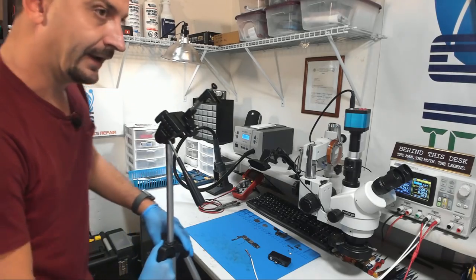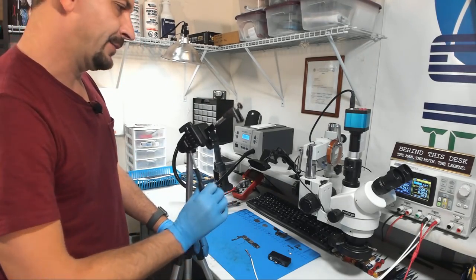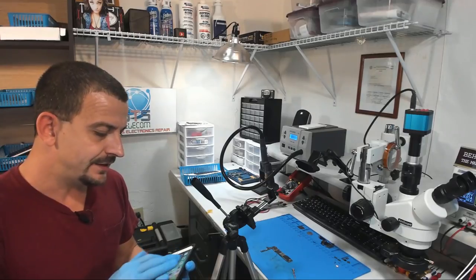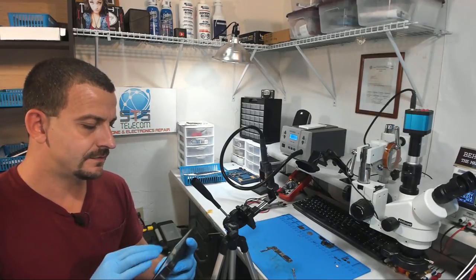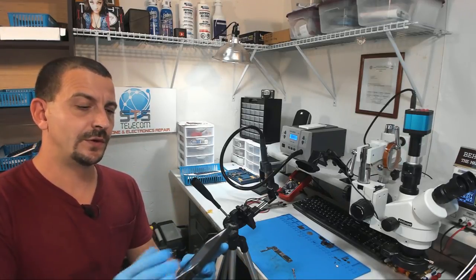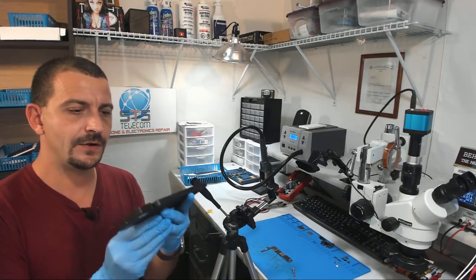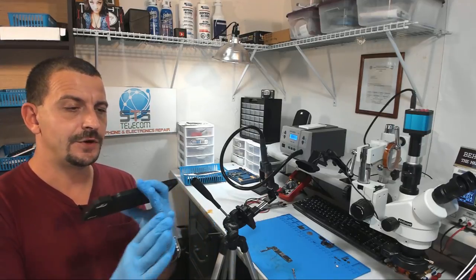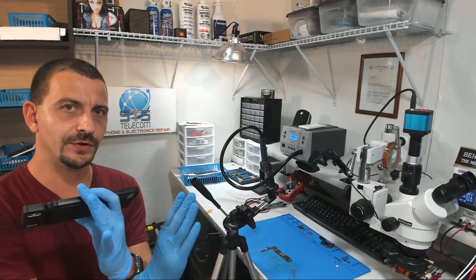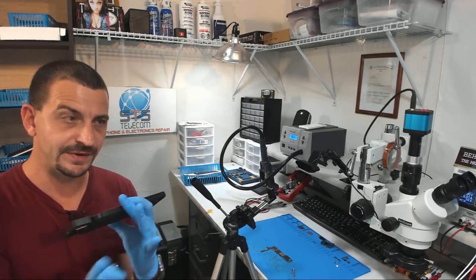All right, how are we gonna do this? I actually have not used this camera on a tripod yet, so I don't, man, this tripod sucks. The distance between your camera and what you're looking at is really important. So once you get this adjusted, if you pull it out and you move it in like this, your visible image and your thermal image will become misaligned.